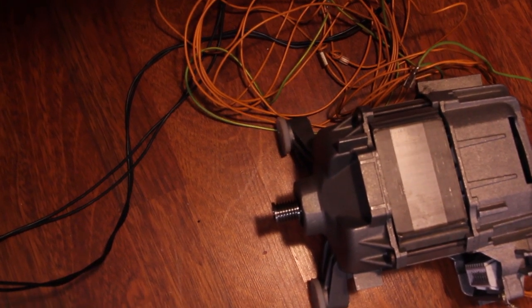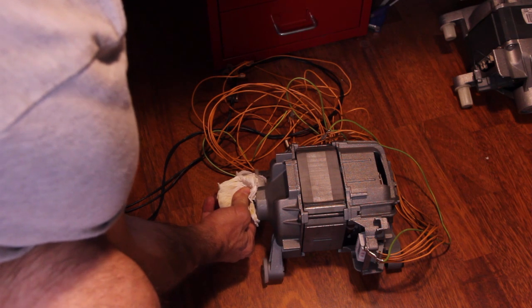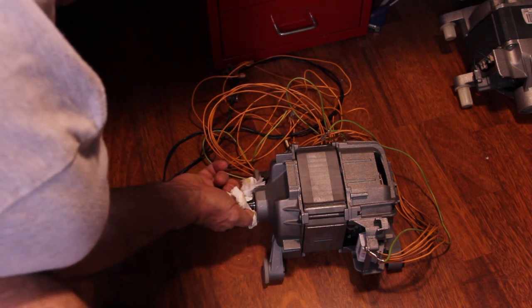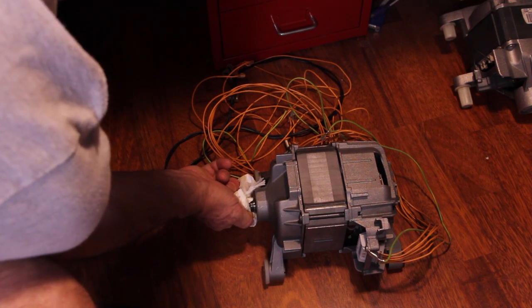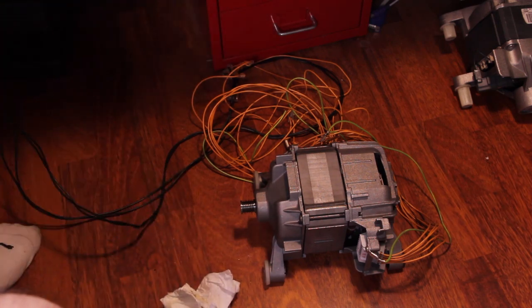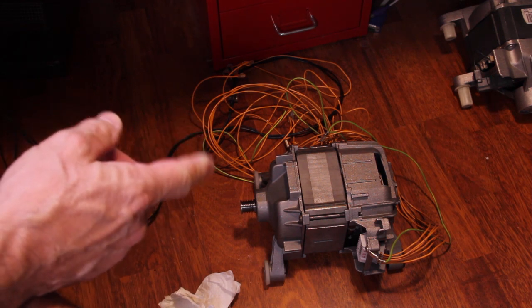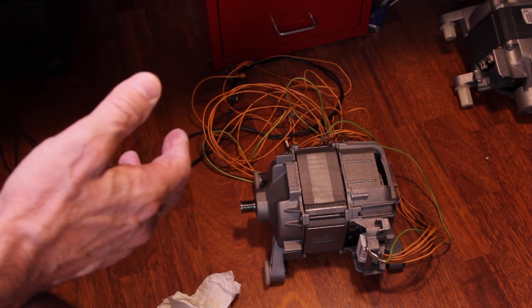As you can see, there is a little bit of instability at low speed. If I try to stop the motor, it reacts and the speed is maintained, even though there's a little bit of instability at low speed. This is because at low speed the frequency generated by the tachometer falls outside the range of stability.